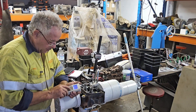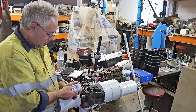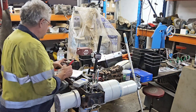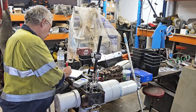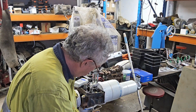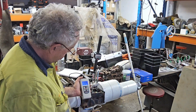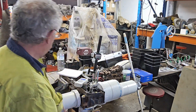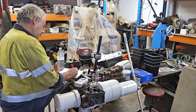What we're going to do is hold this down until it goes to area, and we'll change the setting from 0.036 down to 0.025. We'll do another test. We'll call that 178 CFM at 7.18 inches of water.